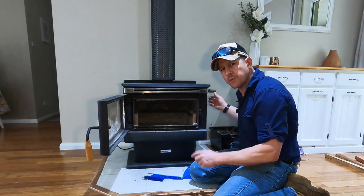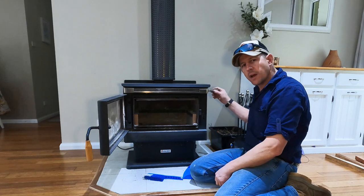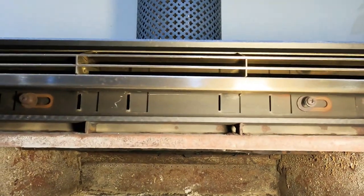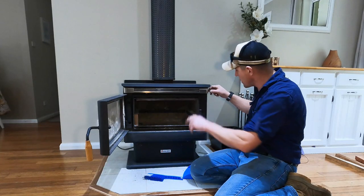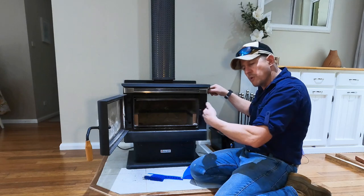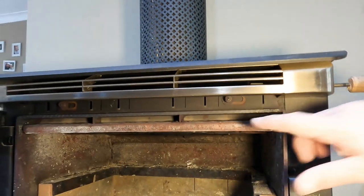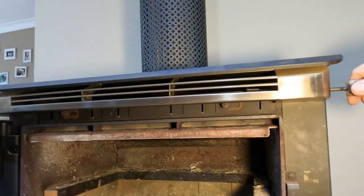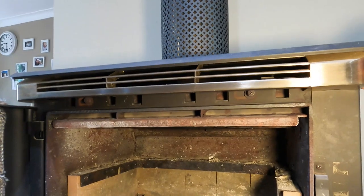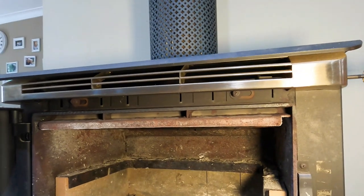The other thing to make sure of is that your dampener is working correctly. If you look up in here on a lot of fireplaces, this gate — the dampener — is really just restricting the airflow into the firebox. Get a torch and just make sure it's unobstructed and operating correctly. I had a mate with a fireplace once where the dampener would move but wouldn't come to the full open position. Just check up in here that it's operating. As I push it in — dampener on — you can see all those holes are free, open, and unobstructed. Then when I go dampener out to put the fire out, you can see it closes off almost entirely — and that's where it's meant to finish. That's operating properly.